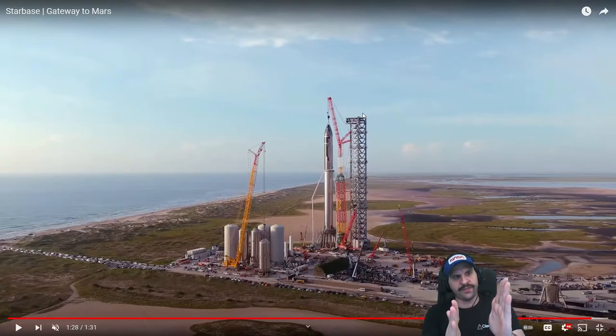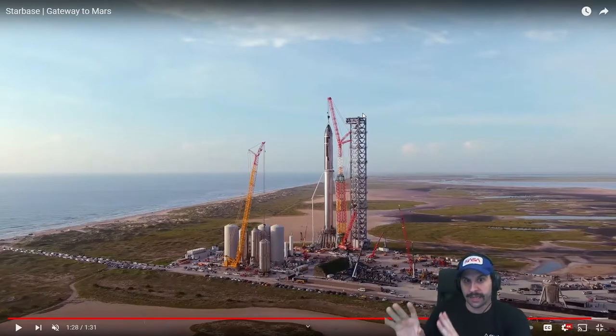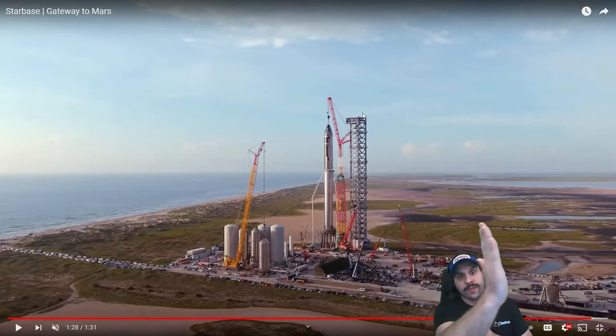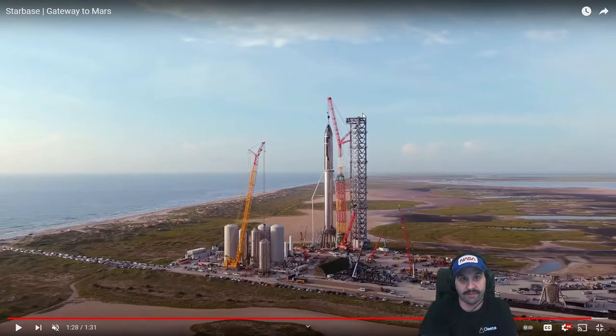But if you're lifting this thing up 70 meters up in the air, when that thing is all the way up there, that's going to have moment over the boom. It's going to swing back and forth. You're going to need to run more counterweight than what Starship is. Not double, you need a lot more, because that thing is going to have more moment. It's going to have a lever over the crane boom, and you have to make sure that the crane has more leverage over the boom of the crane than the payload does. Because if you don't, you're going to go to lift it up, the thing's going to swing from side to side, and the crane topples over like throwing a Lego.